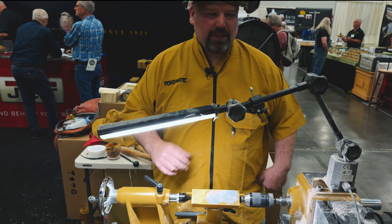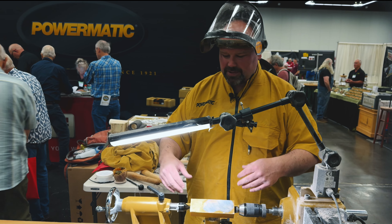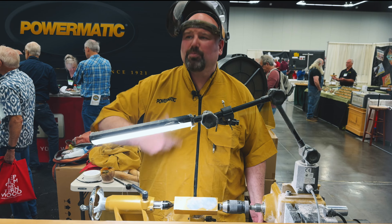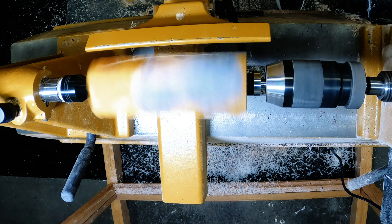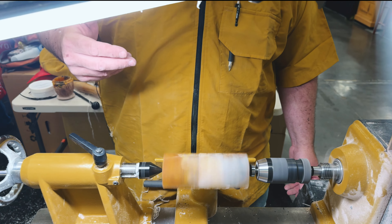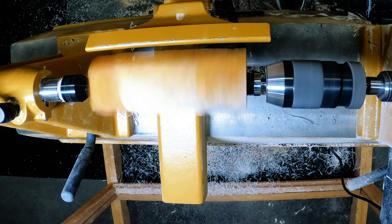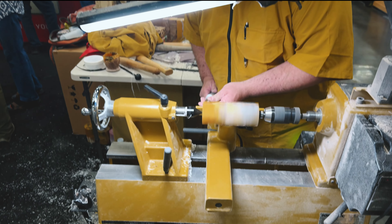A good rule of thumb: always make sure that before you turn it on — right now this is a block, it's not round, so it's going to be a little off center. This is a very small block, but it's just good practice that anytime you start the lathe up, you always make sure the RPMs are all the way down and then you bring it up to speed. We're going to bring it all the way up to speed for rounding. Using a resin blank on this one, we're going to bring our RPMs to right around 1900. We're just going to round it to a circle, using a roughing gouge, just rough this down to a circle.